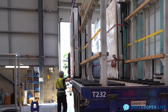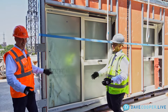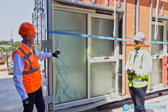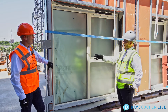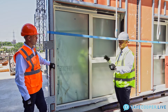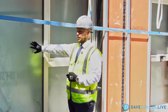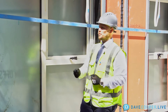It doesn't take much space on site, and the amount of tradesmen you have, welfare parking, CO2 emissions from cars — the whole sustainability aspect. And this is already shipped — the glass is there, it's not broken, it's structurally sound. In terms of thermal performance, this will run a standard 0.4 U-value, but then we'll also tailor the insulation on the outside to the specific environment it's being used in. We work with a customer to do a calculation of the window thermal efficiency and the panel thermal efficiency, and we'll tailor that together to ensure a really high-performing building envelope.